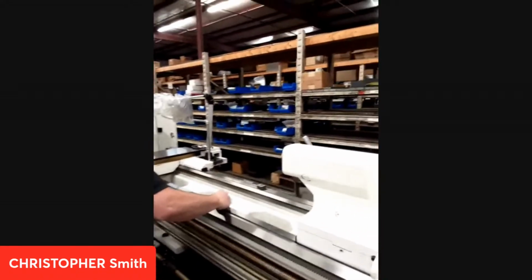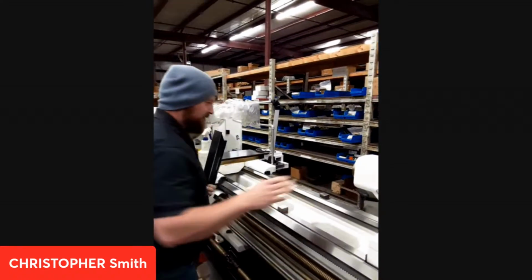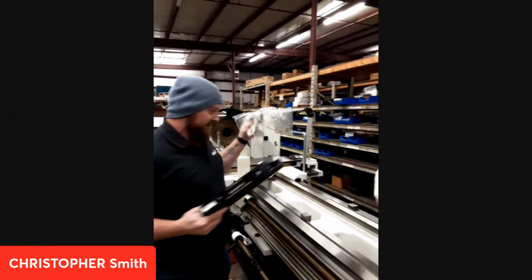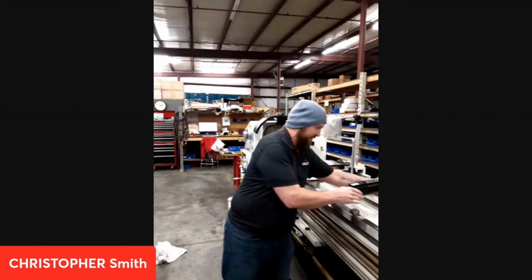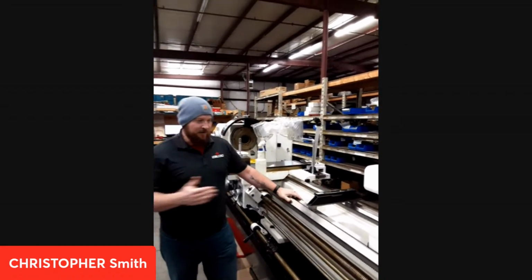You want to rub them in, get a good mating surface, and wipe. You're going to be constantly wiping down the machine, so keep cleaning solution with you. Keep good, fresh, clean towels so you can keep wiping the surfaces over and over. It may look clean, but a hair can throw this thing off, and even your body temperature, the temperature of your machine shop, or even the machine.